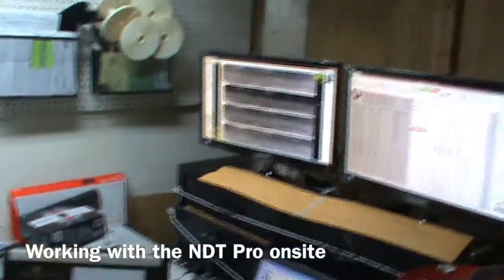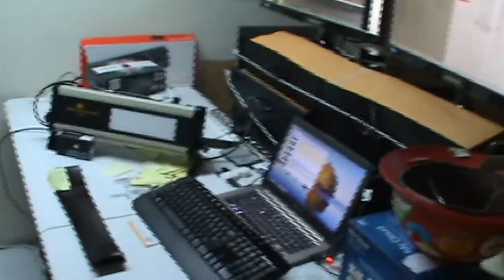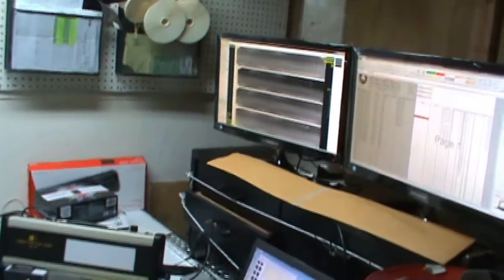They're 4G. Pointing up. So I rotate them, I get them in the right direction, and then I check the penny placement on these. It's got to have two IQIs on it. Then I check the information that the customer wants. The weld number is on here, the date is on here. And when we're talking about our indicators around the pipe, the A is our first indicator, then B, and so on, and when you get back down to D, then your A is your last indicator.